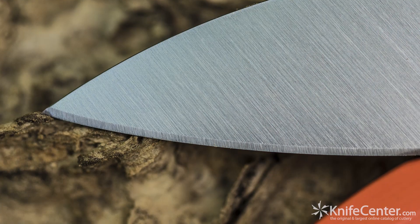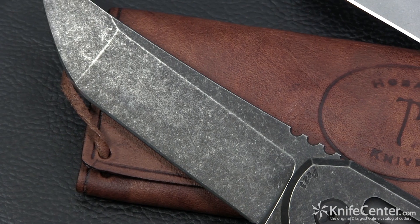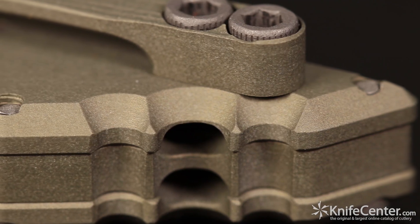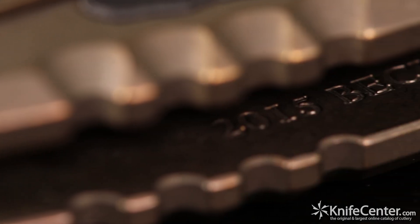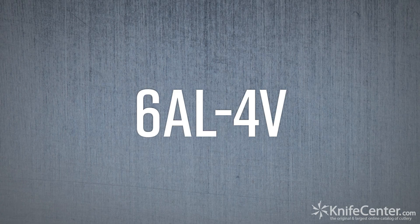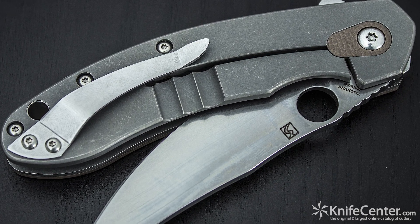What I look for in steels: I want a stainless knife. I always stick with stainless steels — I don't like having corrosion issues with knives. Titanium goes along with that; you're never going to have any corrosion issues, it holds up really well, and it's relatively easy to machine. 6AL4V titanium is the pretty good standard, mostly down to its spring memory, which works great in frame locks and liner locks because it can bend millions of times back and forth without deforming permanently.